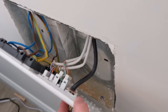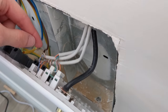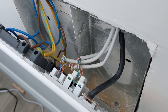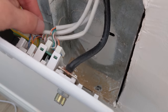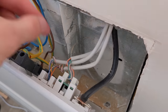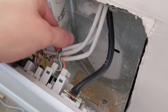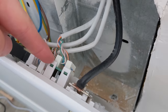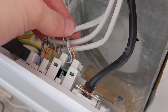So we've got the media panel off - it's actually not too bad. We've got the LCD power over here, the phone line coming into a phone jack and going out again to a port in the hallway. Unfortunately, if there were a phone point upstairs that would have been ideal because it's wired in Cat5 - you can repurpose that cable for network in a lot of new builds - but here there isn't one. Here we've got the beautifully terminated network cable going to this point; they very much untwisted it all before terminating it, but it'll work.